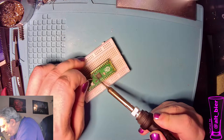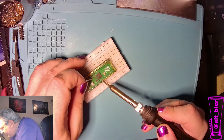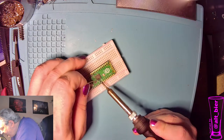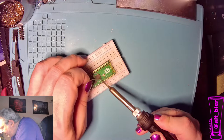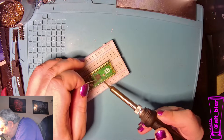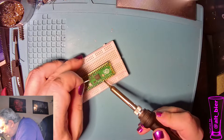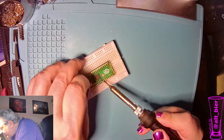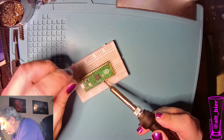the firmware that I loaded on this is CircuitPython, which is similar to MicroPython, but it's software that Adafruit puts out. I really like it, and it makes it very simple to deal with code on these because if you plug it into a device via the USB connector, it's just going to mount like a mass storage device, like any kind of USB stick. And you're going to see, it used to be main.py is what was on there, but now they use code.py as the initial file. And so the code.py file has all of your code in that file.